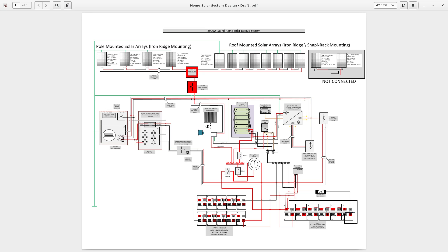My ultra capacitor bank consists of 12 ultra capacitors at 3,000 farads each, connected in series. They are 32.4 volts open circuit and in series they are 250 farads. They are connected directly through positive and negative leads to my inverter.